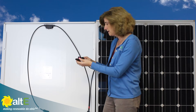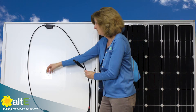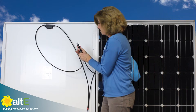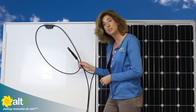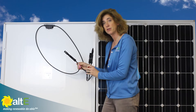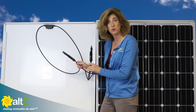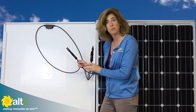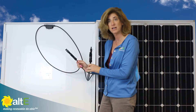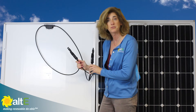Now I'm going to take my negatives and put them in the connector. I now have my two males wired together and my two females wired together. What this did was take my two panels and keep the voltage the same but double the current, because when you wire in parallel you're going to be doubling your current. This is important if you want to keep things at the same voltage but increase the current.